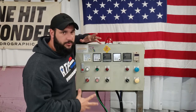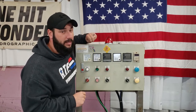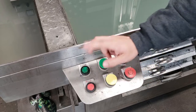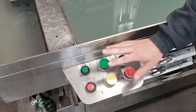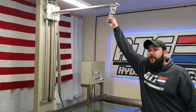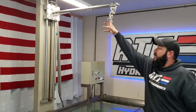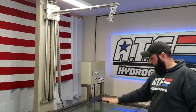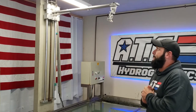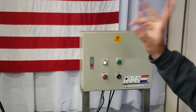With this being a larger commercial-sized tank, this thing pulls some massive power — two 100-amp heating elements, so it pulls a total of 200 amps just for heating when it's running. On the quick access panel on the front, which I use most often when dipping, I have a button to stop and start the pump to clear the top of the water, a stop, start, and reset button for my timer, and a control for the automated dipping arm. That automated arm is hydraulic-based — you can make a jig, put really big heavy items on it, and it will lower them into the water, dip them, and pull them back up. I very rarely use it, but it's a nice addition. There's also a separate control panel specifically for the dipping arm.